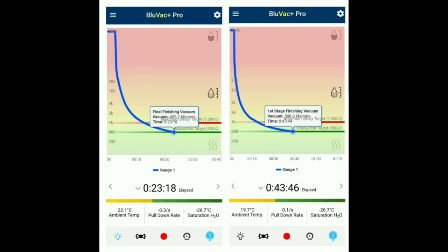So you can see there's a major difference in timing. This is an old recovery tank and it was leaking a little bit. I know that because afterwards I shut the pump off, disconnected everything, just left the micron gauge on, and the pressure continued to rise and didn't stop. So there's a leak in the tank, which may have affected the speed of the evacuation — so that time could have been faster, who knows.